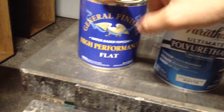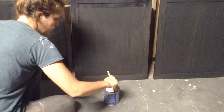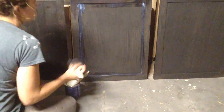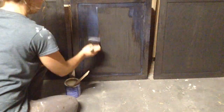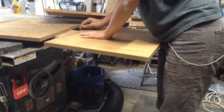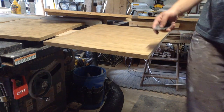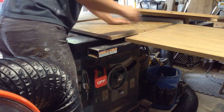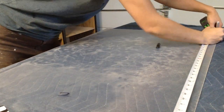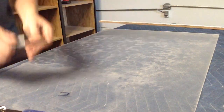The front edge and the doors will also get the black — I put one coat of stain on. For the top coat I'm using a water-based finish because this isn't really a utilitarian piece of furniture. I usually prefer oil-based finishes for oak since I find them more durable, but this is just going to store some stuff and the customer told me she's probably going to open these doors maybe three times a year. I put a nicer grade of water-based finish on the visible parts — almost $50 a can — and got a much cheaper finish, the Varathane poly, for the inside and parts you won't see, since that premium can would have cost almost $200 for the whole cabinet. It was easily half the price to use the cheaper finish inside. I also put a coat of poly on all the sides and the back just for continuity.